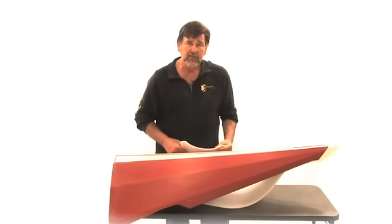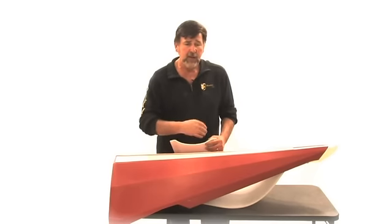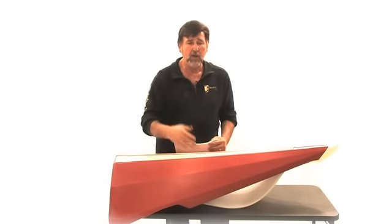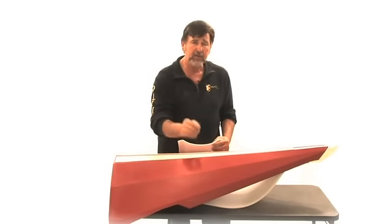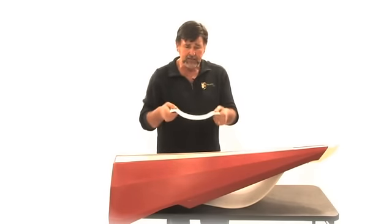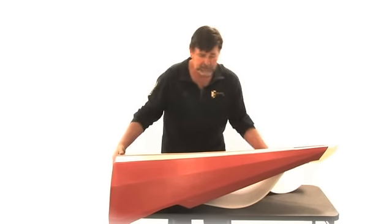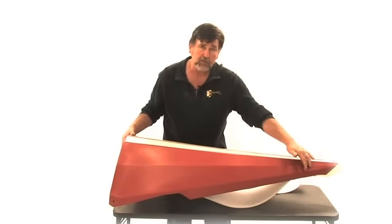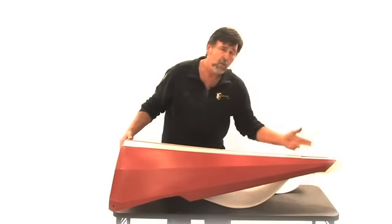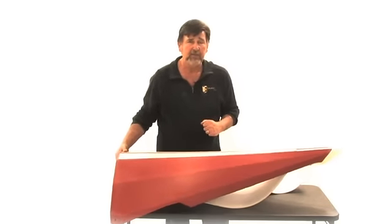Here's an option that was really developed for people with irrigated corn. In irrigated corn, you have tire tracks that really develop a bit of a rut, and we need something to help support that snoot, the point of the snoot, to bridge and jump over that rut. Of course, the standard Drago has a very small, simple bubble tip on each snoot. What we've developed here is simply a very long and extended bubble tip to help support and bridge and keep that point away from that tire rut, get it over it, so you have less buckling problems in the field.